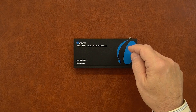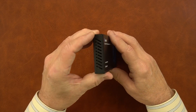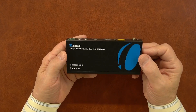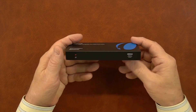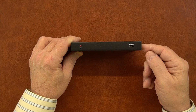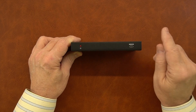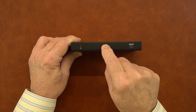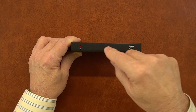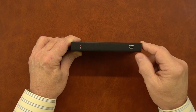The receiver module features a full metal enclosure as well to help minimize outside interference. On either side of the receiver modules you'll find venting slots that let any heat generated during operation escape to keep the internal electronics at a comfortable temperature. On the front of the receiver module, starting on the left, you'll find a power indicator. The module doesn't require local power because the sender module employs power over cable technology — the minute power is added to the sender module and the network connection is made, all the power needed to operate the remote location will be provided, and this LED will light up indicating valid power.